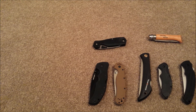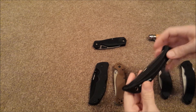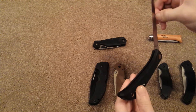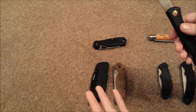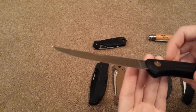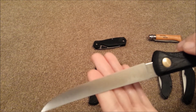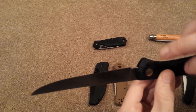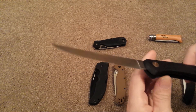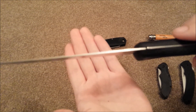The last knife on my list that I've actually measured new out of box is this Normark Fillet Knife. This is probably the thinnest ground blade I've ever purchased in 20 years. I did recently re-profile it on the Wicked Edge because it needed sharpening, but before that with the stock factory edge this one came in at 0.04 millimeters — below 30 degrees inclusive. It is ground extremely thin and also very thin stock, so it cuts very well.